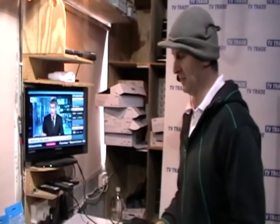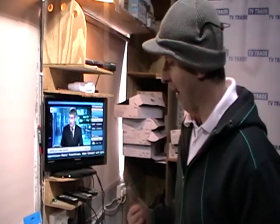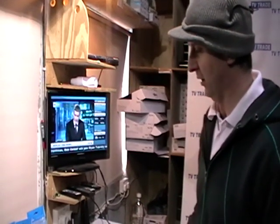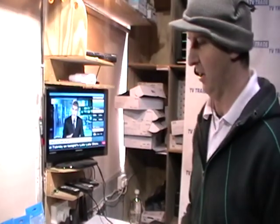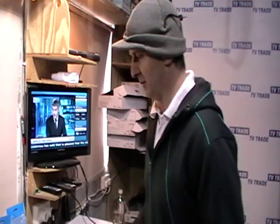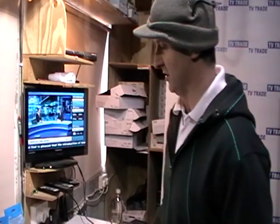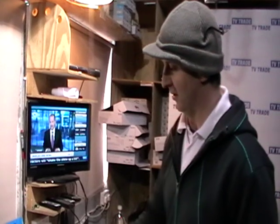And the third reason, and this is probably the most important reason this is being used, is that the maximum length, even with extremely high quality HDMI leads that you can run a lead, is 20 meters, and often this just isn't long enough. In houses, we'll say, where they have a central distribution point in the attic distributing HDMI to lots of different rooms, you might find that many of the runs are over 20 meters. So for that reason, it can be very advantageous to run the signal through the Cat5, which of course is cheaper than HDMI per meter, and then just converted with this.